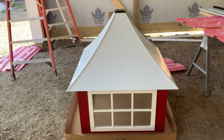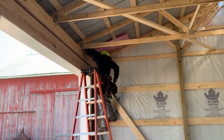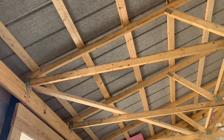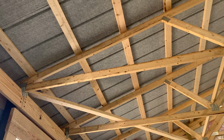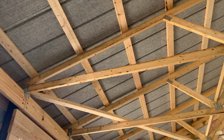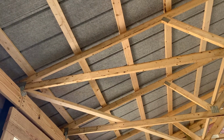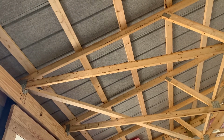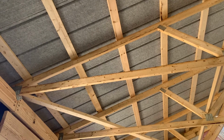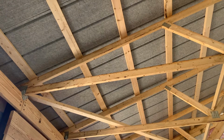You can see what Alex is doing up there. He's putting the baffles up there. And now this building, you can see here, you've got drip stop metal. And again, different than vapor barrier. Drip stop comes pre-assembled to the existing steel right there, so it acts as a condensation barrier. Now it's easy to wipe down. It does have a 20-year warranty on it, and you can power wash that. And again, 20-year warranty on that.